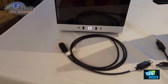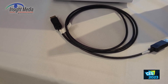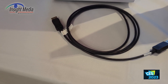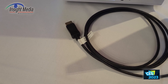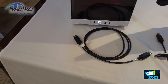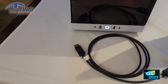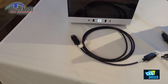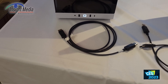In this next demo, I want to start by talking about their DisplayPort enhanced cables. I was always under the impression that cable length for high-frequency transmission was limited by the cable itself, but that's not necessarily true. A lot of the high-frequency limitations actually come from the connector itself. During COVID, engineers worked on enhancing the cable by spreading out some of the connectors and doing better shielding — this is not a twisted pair — which helps with EMI and increases the usable cable length.